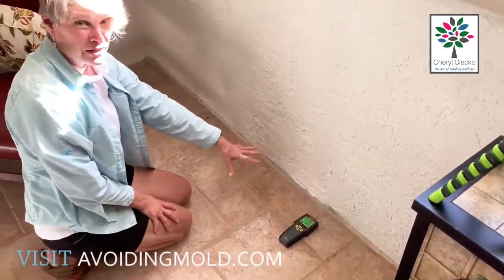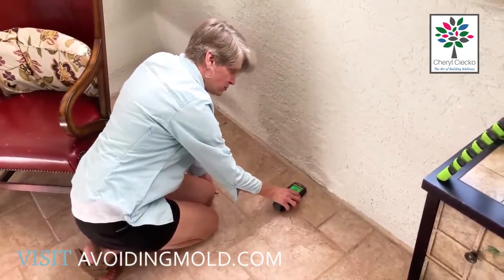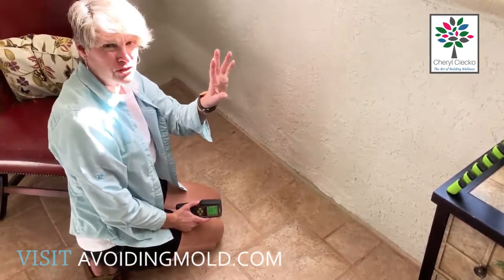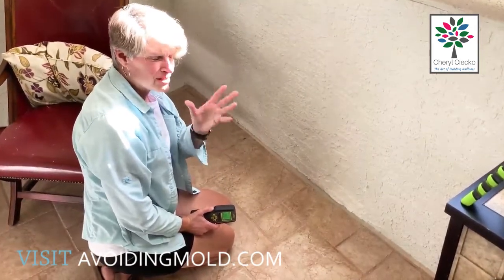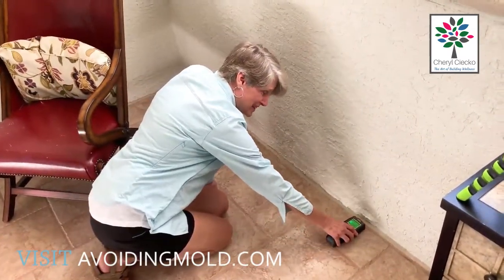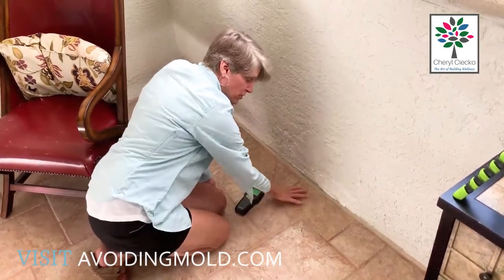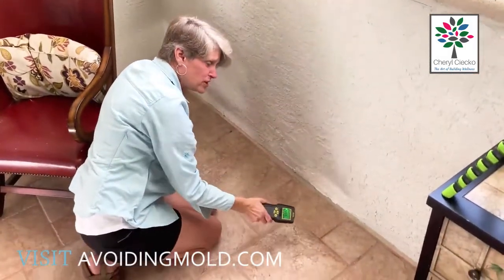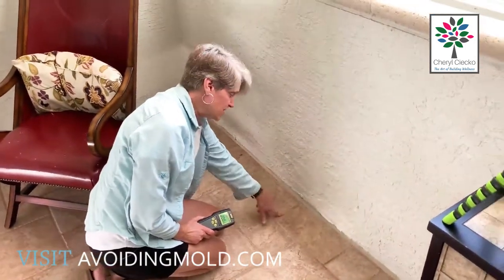So this is a lot of water right here. It has not rained recently — they did have a hurricane, it's Florida actually. You can see this is reading in the 40s: 48, 47. So if that side was 30-something — 35, 36, 37 — then if it's 38, 39, 40, I wouldn't get too worried. That's in a realm that's interesting but not definitive. When we're getting 56, 74, that's significant. This tells me there must be water stored under this tile coming probably from the outside. I would probably remove one tile or look at it from the outside to start. This is not likely to cause mold from what I've seen because it is drying out through the grout joints.